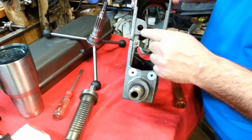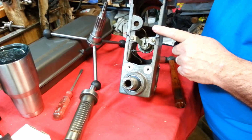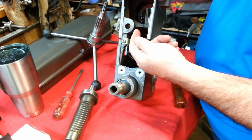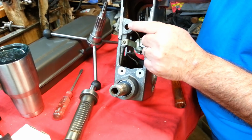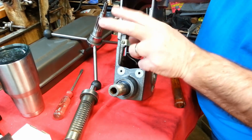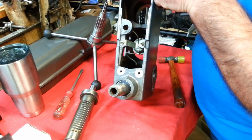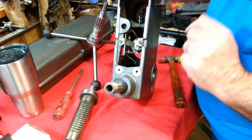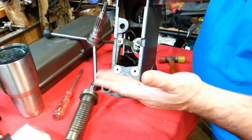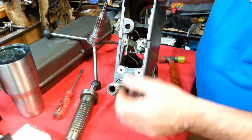Notice this 14 millimeter hole. Do you know what that's for? Oh, that's for a speed reducer that this drill press didn't come with. But it could be made easily. It would just be a shaft that fits in here, a plate that comes across, a shaft welded to the plate, I presume, and then another shaft coming up with a pulley that matches the motor pulley. So we would put this cone pulley on in the same orientation as the motor pulley, which would be like that. We would flip the motor pulley over, and then we would go to two belts, and then we could get a super slow drill press. So if I come across a pulley that matches, which I'm going to have to buy a motor pulley for something from this era, probably a lot of them are the same, then I can build that.